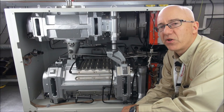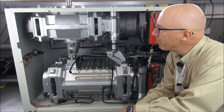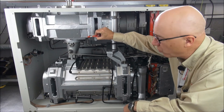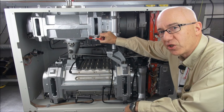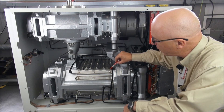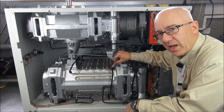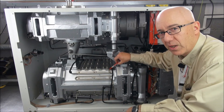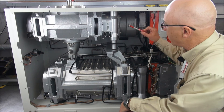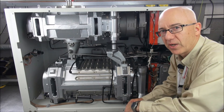The GXS is fitted with various temperature sensors to enable the automatic temperature control system to function. This is the external temperature sensor of the mechanical booster (MB), located on its exhaust side, giving the indication of the MB temperature. The dry screw pump has an external temperature sensor referred to as the TCS reference — temperature control system reference. This is the external body temperature, but there is a computed internal screw temperature which is actually the DP temperature reported. The motors and inverters also have internal temperature sensors to enable monitoring and control.